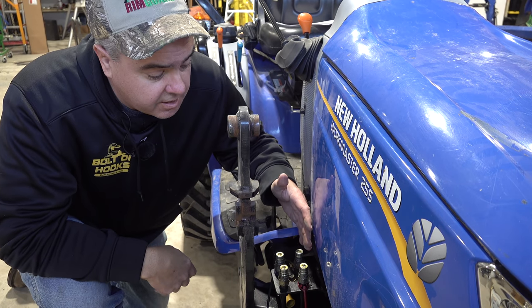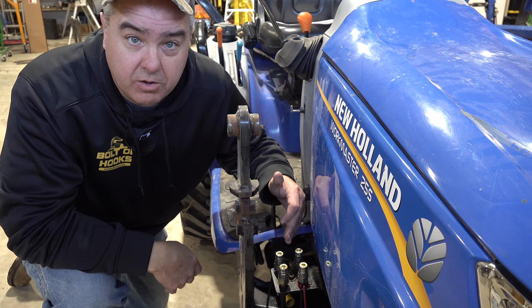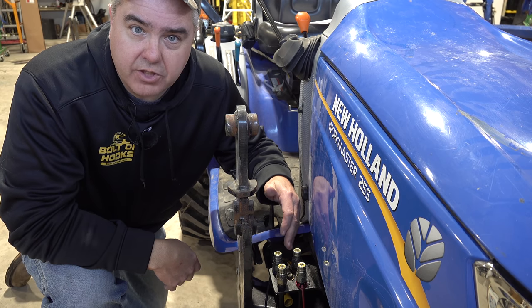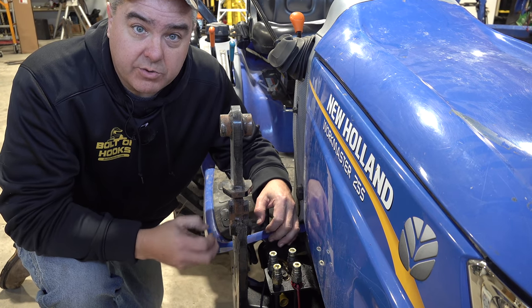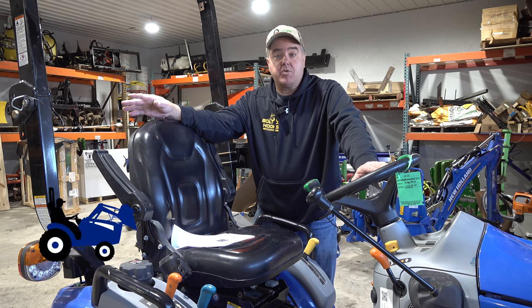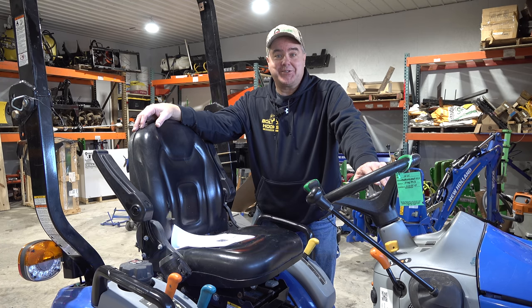Looking at the quick disconnects — you'll see old oil with dust around them. You can immediately look at that and wonder if there's a problem. But don't immediately assume there is one just because you see oil at the base of the quick disconnects, because a little bit of oil will spurt out each time you connect or disconnect them. If you get the opportunity with one of these small tractors, I'd suggest you remove and reattach each of the attachments. There's an enormous amount of learning that will take place during that process — you'll be able to detect if items are bent and get a better look at the tractor and the attachment.